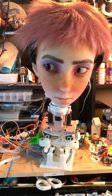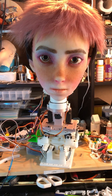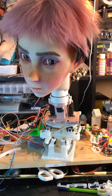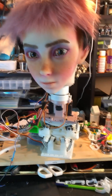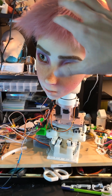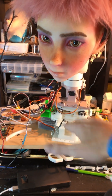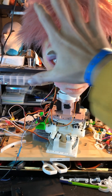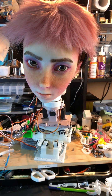Here's where I'm at now: I've got three motors for the eyeballs and five motors for the neck, so it can achieve some pretty expressive poses. It's a bit loud. Basically the head can achieve three axes of rotation. Down here I've got this thing going on to get some other motions going on, so the head can sort of plane backwards and forwards while remaining parallel to the ground.